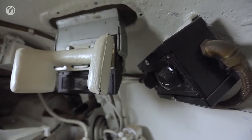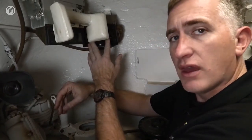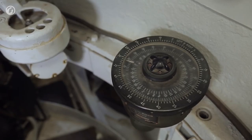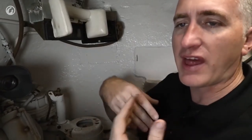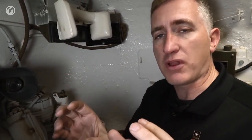Other things in the gun's compartment: there's the rheostat for the stabilizer system, and an azimuth indicator for indirect fire — that gives you the line of bearing horizontally. For elevation, you would use a gunner's quadrant and simply place it onto the breech block. Other than that, this is a comfortable position, very ergonomically well designed. The gunner can get the most out of this tank.